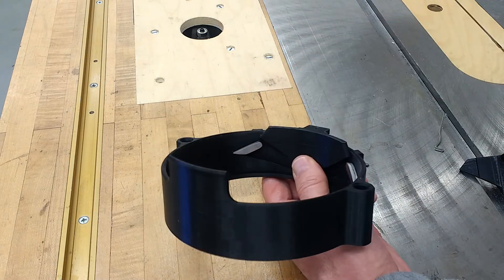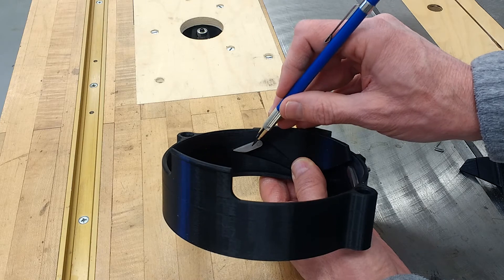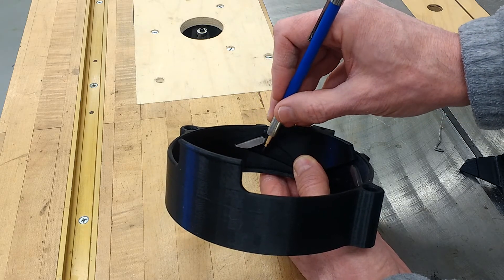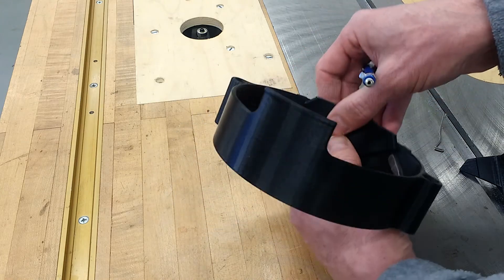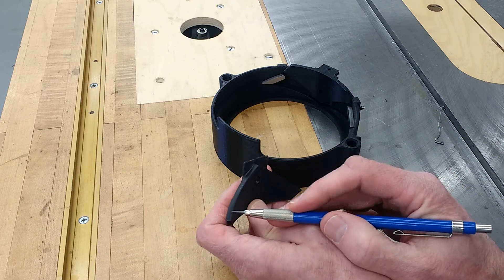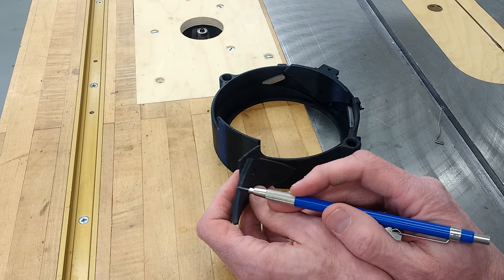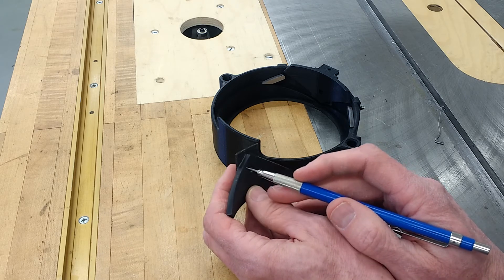While we're looking at this — the upthrow cams: I've seen some people have these reversed. There is a left and a right hand, and the angle on the upthrow cam should match the angle on the clamshell. Make sure you don't have that reversed because some people had it going up real high. Next is sanding — you'll want to sand the inner and outer surfaces. It'll work without sanding but it'll work a lot better if you sand it, and even better if you use some lubrication.